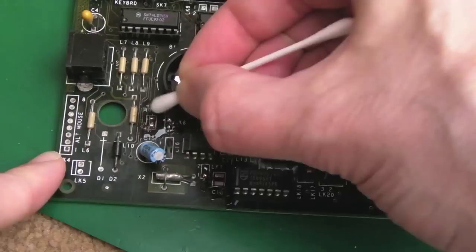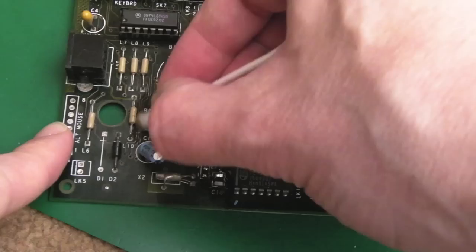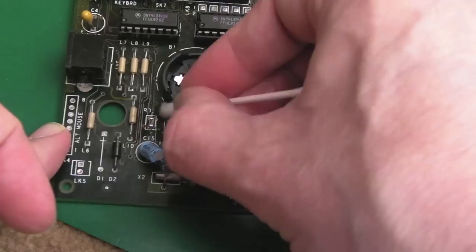The resistor here, you can see, hopefully I've reflowed that. I got all the crusty solder off there, put some fresh solder on, used the fiberglass pen a little bit. And that one's okay. That's just the 180 ohm resistor on the ground side of the battery there. Nevertheless, these are things that needed to be done. They were perhaps the last things. Can you see these little pads here as well? There were two little jumper positions here, like links, and they just looked a little bit oxidised, despite the fact that I've cleaned up. So I've just covered those with little blobs of solder.